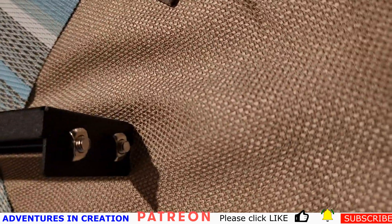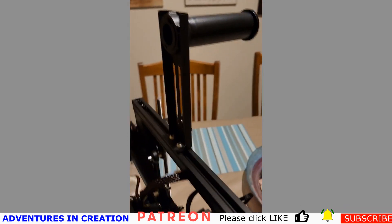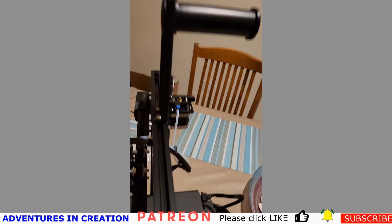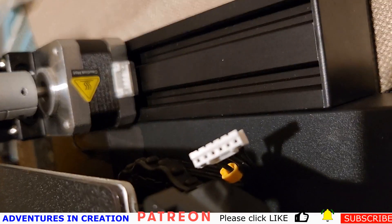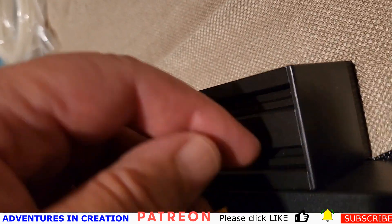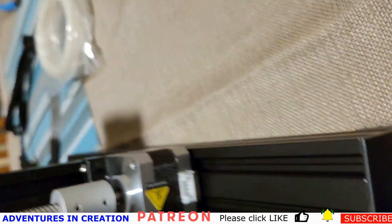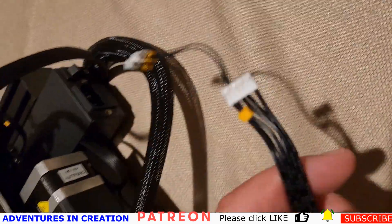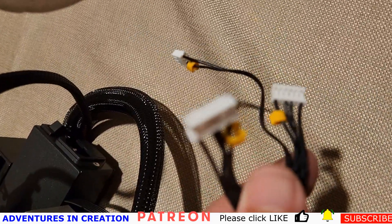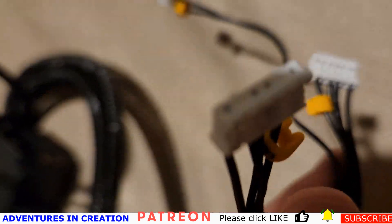But the SD card actually goes in the front of the printer. The spool holder goes on with a couple of T-nuts as well, just fitting on the top gantry — obviously you don't want to put anything too heavy on there. Then you just have to connect up these cables. They're all different sizes so you can't get them in the wrong holes, but they're close enough that you're not going to go crazy. You don't want anything stretched — if you're stretching stuff you're probably putting it in the wrong place.